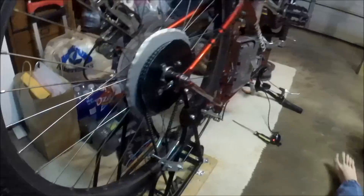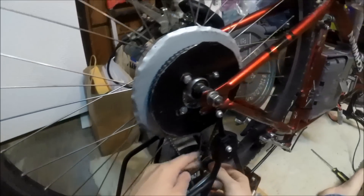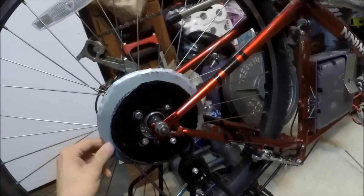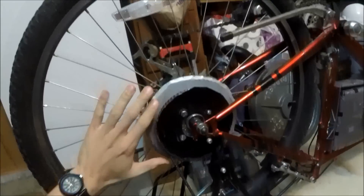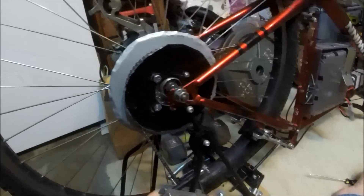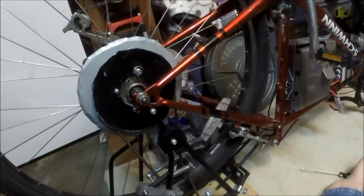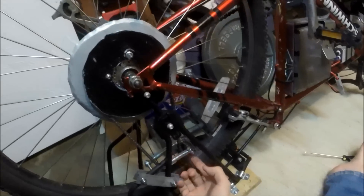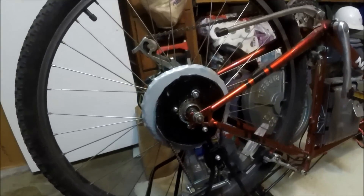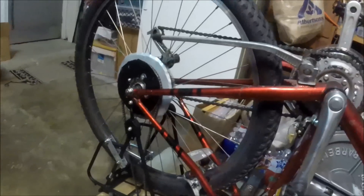Without any weight on it to prevent it from accelerating too quickly, the chain has jumped off its little tensioner gear and gotten stuck on the wrong side of the washer. That's what was happening before I put the washer on there. Because it's so off-center, it's causing the chain to have more and more slack on the downswing of each rotation, which causes a problem for the chain staying in place. On the other side, when it goes all the way back around, it's very taut. That's what the fourth iteration is designed to fix. Hopefully this was educational — if you have any questions, go ahead and leave a comment below.